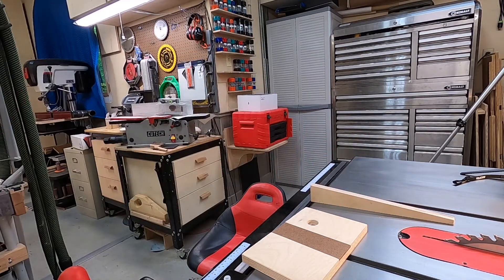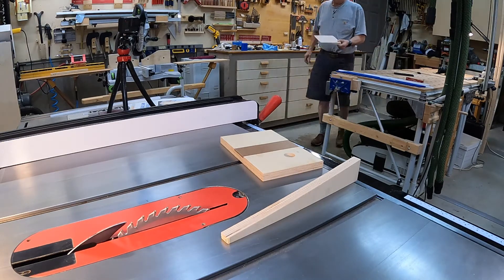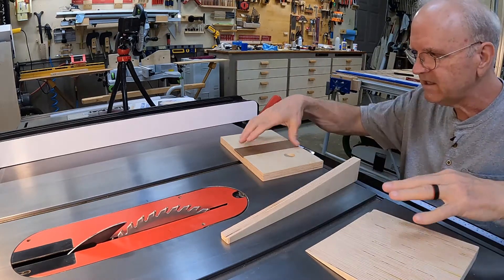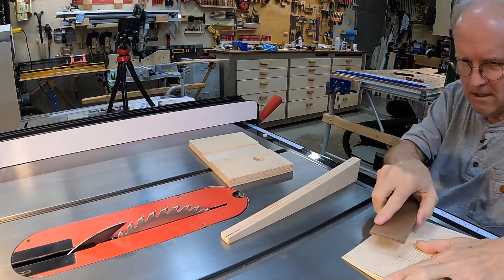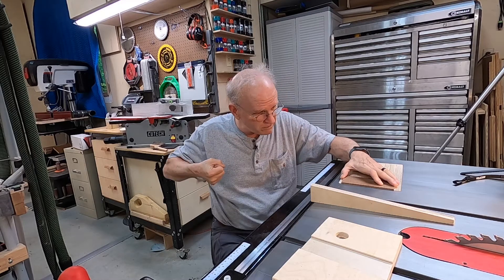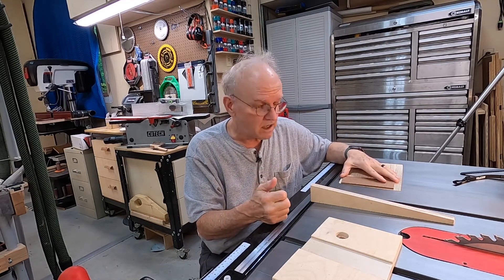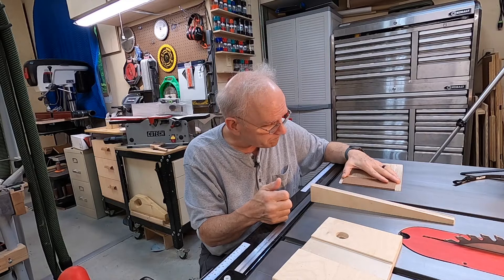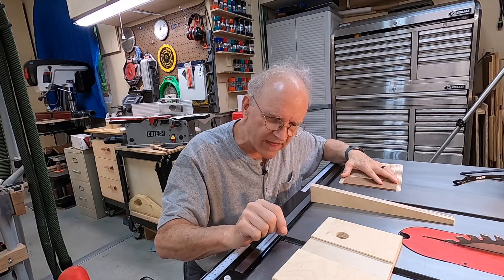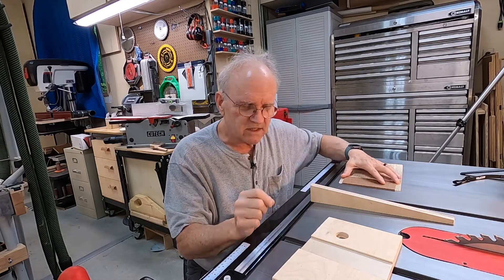That was another part of this project — I had to build a ramp that fit seven degrees for my shooting board. I cut a number of these seven-degree ramp-angle pieces and glued a bunch of them together. So I lay this hardboard down against the ramp, and now that angle is vertical so my shooting board as it comes through will shave that off. You can shave off a couple thousandths of an inch at a time, see if it fits, take a couple more thousandths off, and pretty soon you'll get it just right.